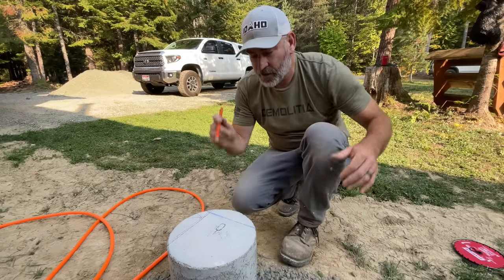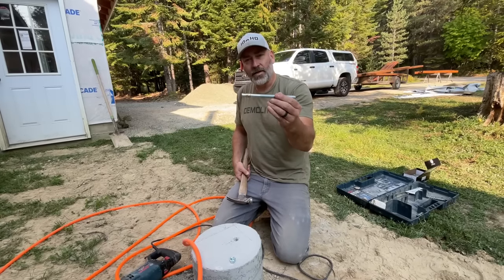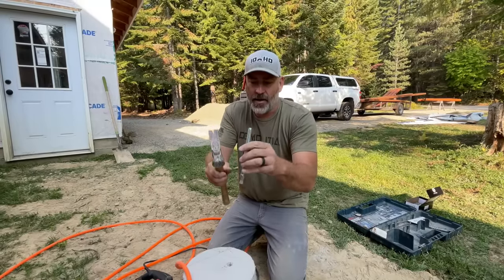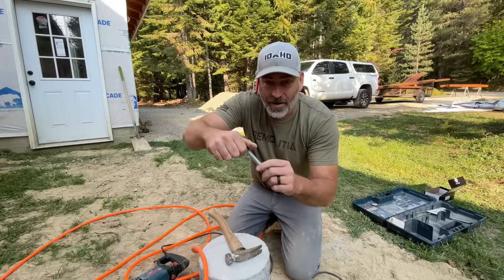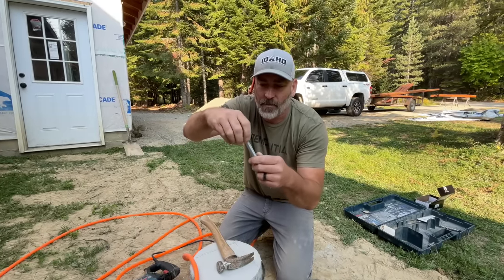We go ahead and draw our circle, drill a hole right there. We're going to blow this thing out - I can't find my little blower so we're just taking a fitting, put it on here, blow it out. These are called redheads - that's just the brand name, this is a generic type - but you take this, pound it down in the hole, this thing expands down there, and when you tighten it down it really clamps down in there and makes it super solid. First you've got to tap it in. Normally if you're going to pound on the end of a bolt you want to put the nut on because you'll mess up the threads, but these are tapered at the end special so you can tap them right in.